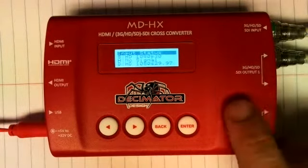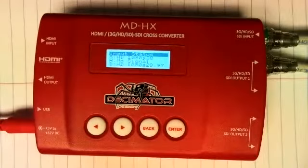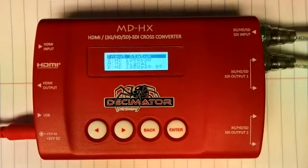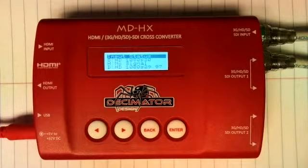The main thing I want to point out about this device is there are a lot of video production devices out there that are looking for broadcast signals. Our cameras here at PTZOptics only output standard solid frame rates — they don't do any incremental ones. Our PTZOptics cameras put out frame rates like 1080i60, 1080p30, 1080p25, 1080i50 — a bunch of standard solid frame rate signals.